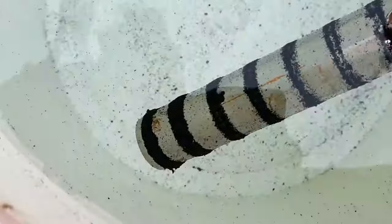I've been flushing it some more and you can see now I've got even more dirt inside the bucket, and that's not including what's on that magnet down inside there. So you can see by doing this flushing it all through, you get your radiator nice and clean and your system working more efficiently, and hopefully your house will then be warmer. Now all that's left to do is drain the radiator out and then you can go and refit it on the wall. I'm just going to make sure this valve here is shut and this one here is shut also. We can just undo the valve — or another way is to turn the radiator over like this — then undo this valve here. That was just finger tight, so take that valve off, make sure it shuts and the water runs out. Then undo the valve on the other end, and then I can just pick the radiator up and pour the rest of the water into the bucket.